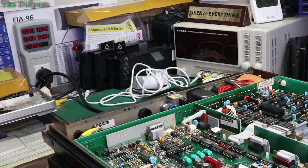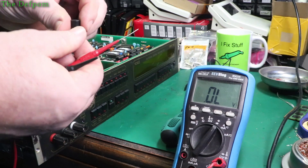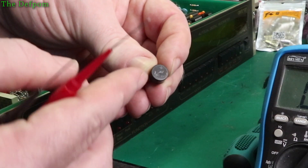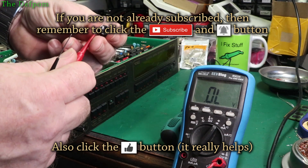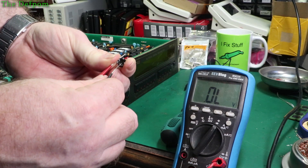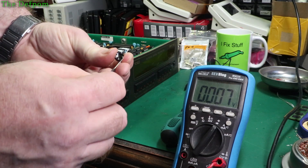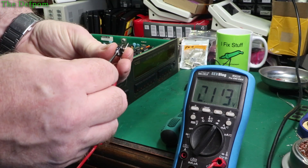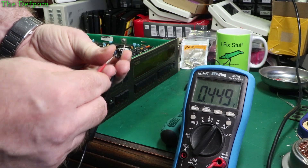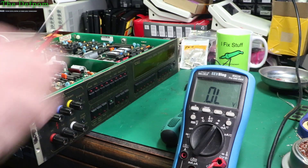So we've got the AC input on the sides and the positive and negative there. It's basically four diodes inside a single package - you can use diode mode on your meter to test it. One AC connection - 0.4, okay. Going to the connection on the other side - short. Reversing the probes - still a short. Got a blown diode. That's 400 as it should be on the good one. So yes, this diode between these two connections is shorted out. That's why it's trying to put DC back into the AC circuitry, which is then overloading the transformer. So I need a new bridge.